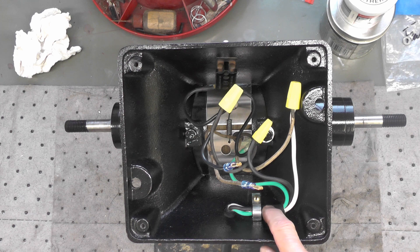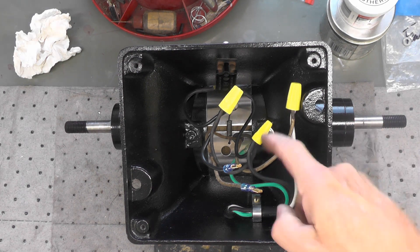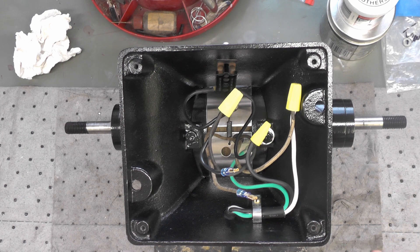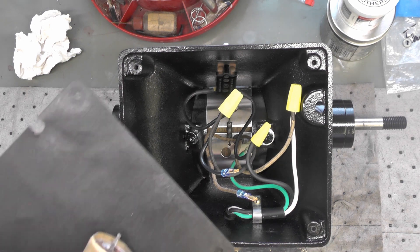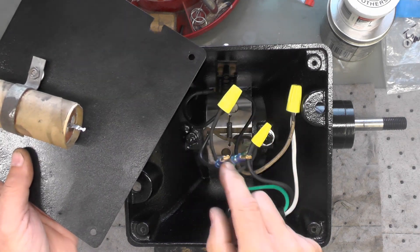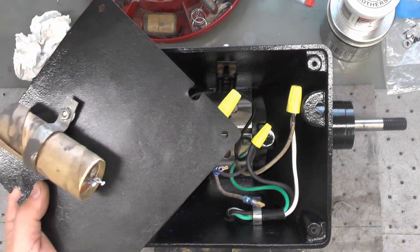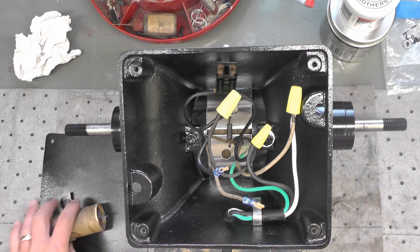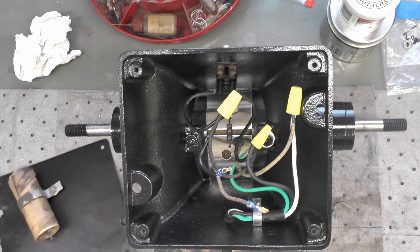There's a new power cord coming in here. Most — in fact all — of the hardware here is original, including the wire clamp at the bottom and the bolt holding the base to the motor. Here's the capacitor, and these two wires with plug-on connectors go onto the capacitor terminals and just slide on. I test-ran the unit just a few minutes ago and it runs fine, so I obviously got the wiring correct. The next step is to complete the base unit with the capacitor inside and button up the wiring and base.